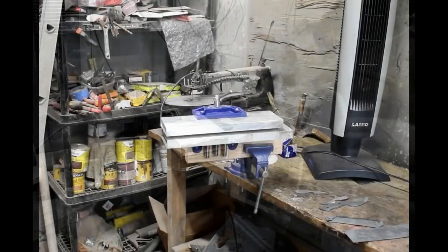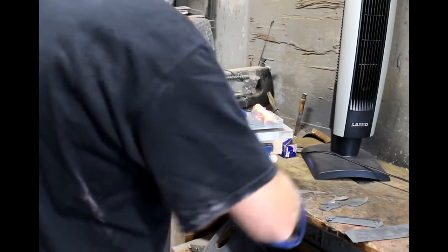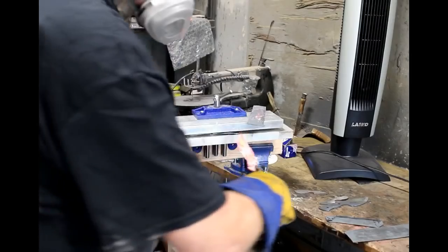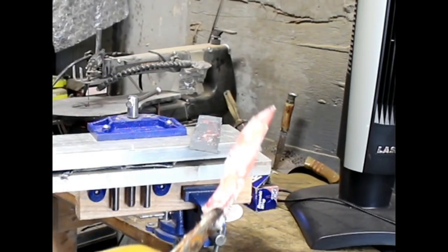It takes a few minutes for the blade to cool down and then you can unpack it from the tool wrap. This is a tool wrap knife going into the plates, and this is the aluminum foil knife. The main reason why you can't use aluminum foil is that all of the aluminum foil melted and it's completely gone — actually some of it is embedded into the blank. So no benefit at all to using aluminum foil instead of tool wrap.